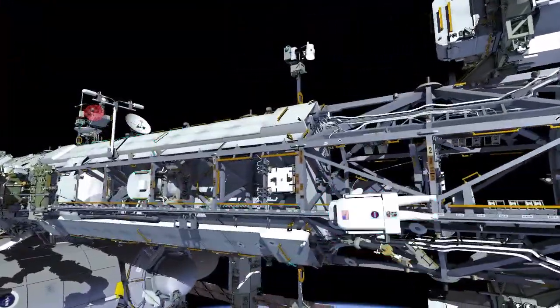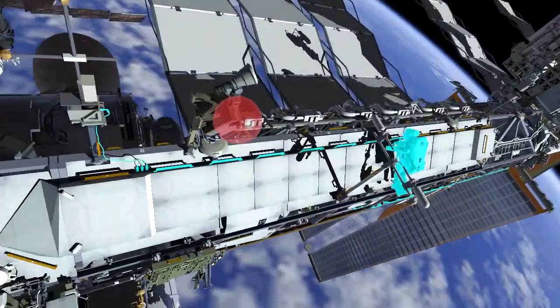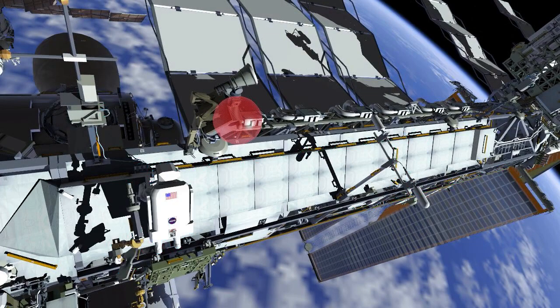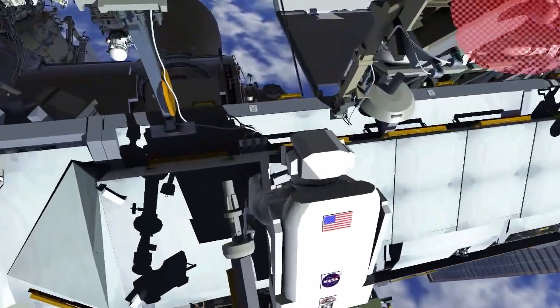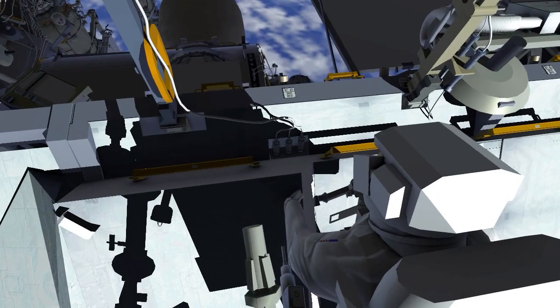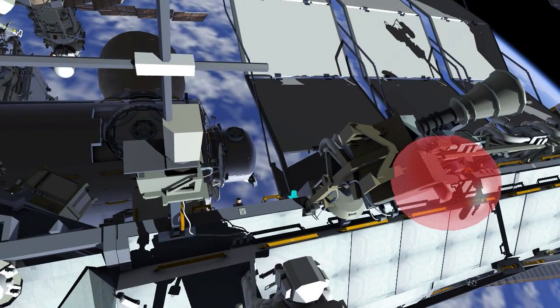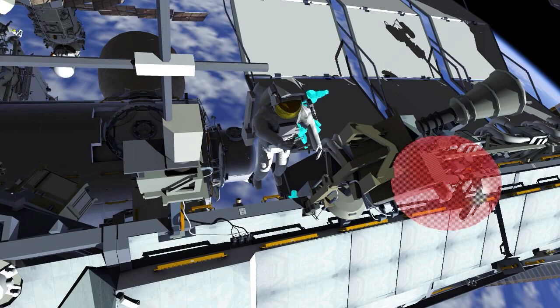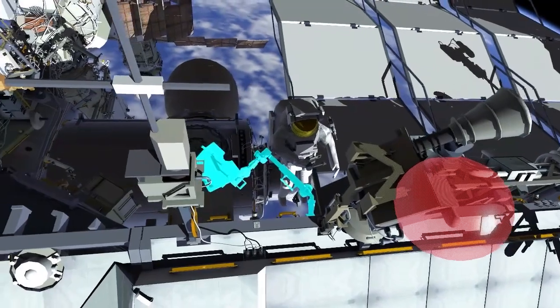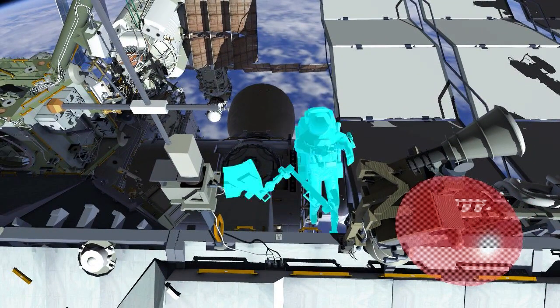He'll pause momentarily at the FHRC, where he'll go zenith to the zenith handrail path, and then over to the P1 FPMU. He will pause to unplug and put it in EVA electrical inhibit by pulling a connector aft and then installing the foot restraint at the work site. He will work to configure it to his optimal position and then ingress into the foot restraint and prep for removal of the FPMU.